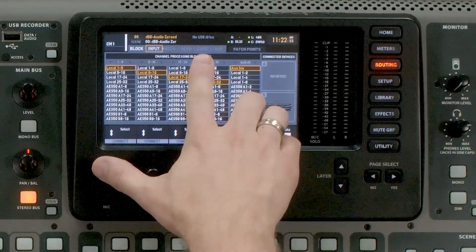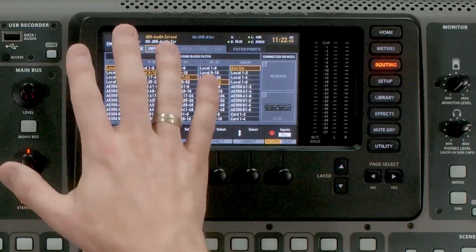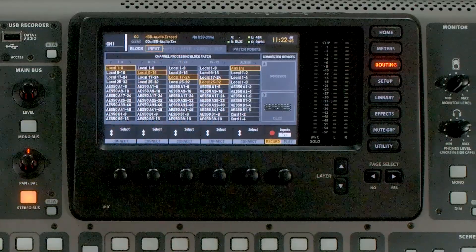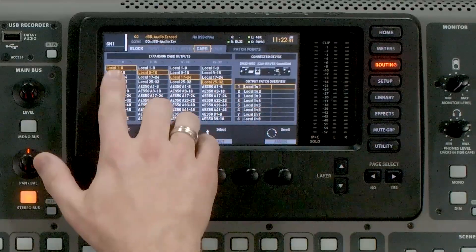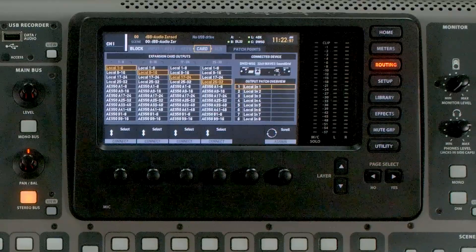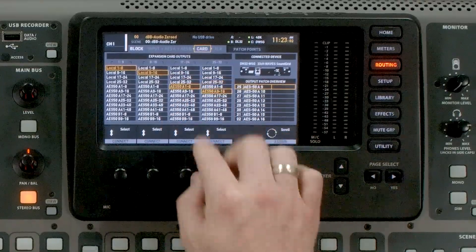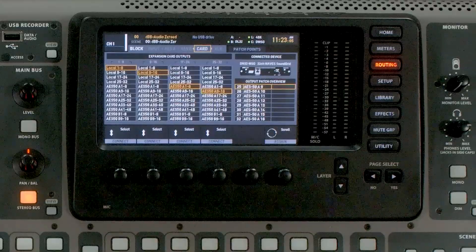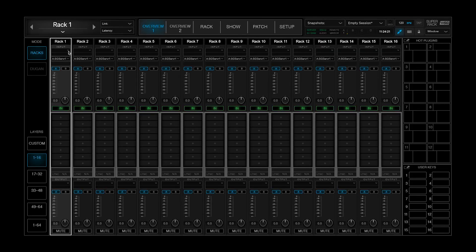What we want to do is match our inputs that we have here. If you have any routing coming in from your AES 50, you'll want to copy that over to your card settings. In this case I have all of my channels coming in on local, but if you have a smaller version of the X32 — like a compact or a rack — with only 16 channels and a stage box on AES 50, then you can select AES 50 for the remaining inputs. Once you have done this, all of your audio from your channels is going into Waves, so we can jump over to Waves and route our input.